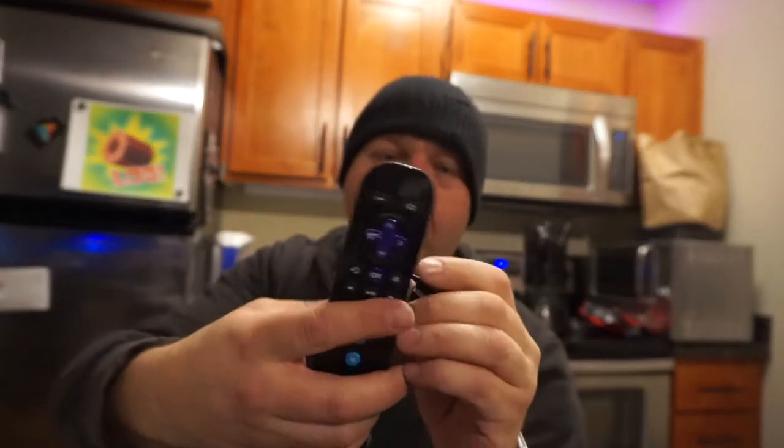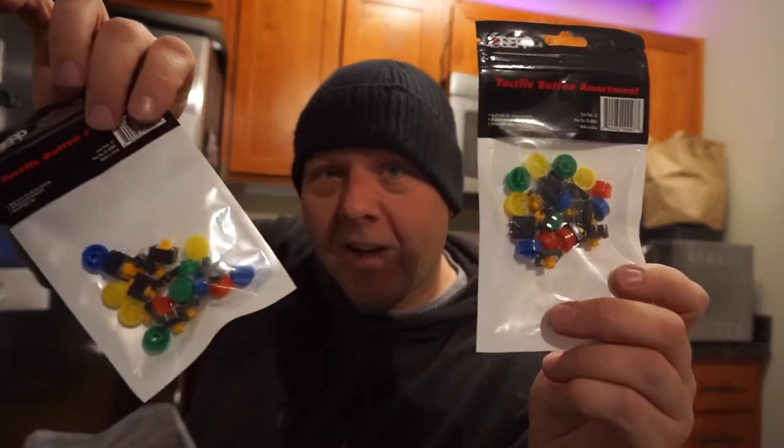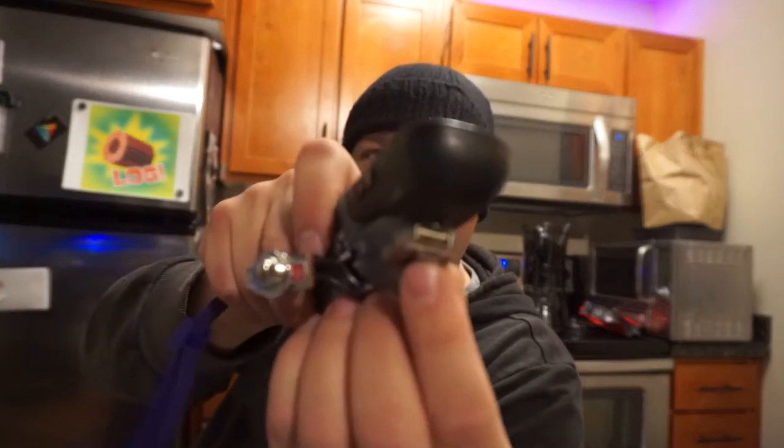This is the secondary reason I went to Fry's - remember when I modified this Roku remote and put the rechargeable battery in it with the charge controller? I had to add a switch to the side because it was acting weird, and now you have this big ugly thing. I got a project box, 24 multi-colored tactile buttons, and 50 feet of 26-gauge multi-stranded wire. We're going to completely disassemble this, take out the PCB, install the buttons on the box, put everything in the box with an 18650 battery and a battery holder, and cut a hole in the side for micro USB charging.